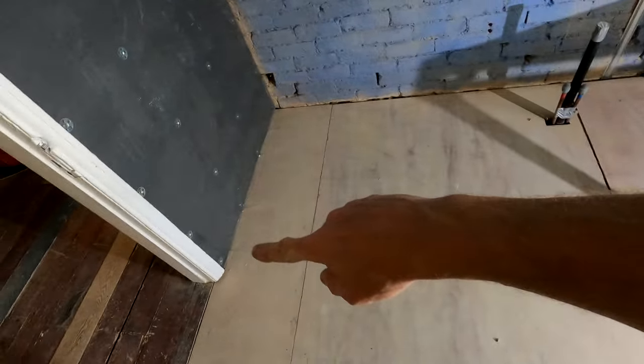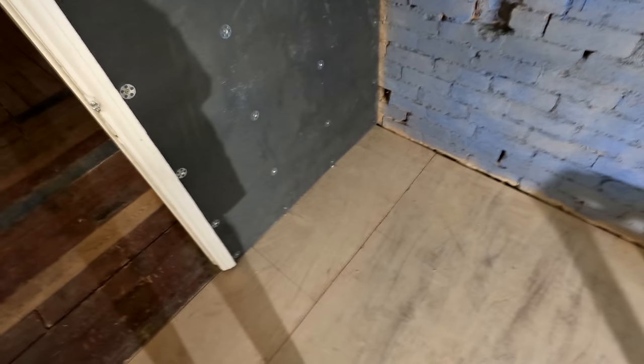Like I mentioned before, this is a ply floor in here because this is going to have underfloor heating and tiles. So these are all cut to size. We just need to get our waste cut in here. Once the tray actually arrives, there was a little bit of an issue that we did get sent the wrong one. So we weren't 100% sure where the waste was.